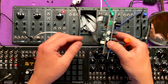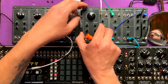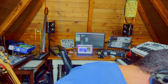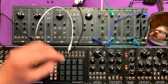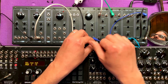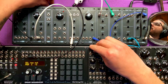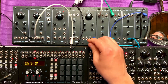So now we can put this back in the case. Let's turn off the case just so there's no shorts. Simple as that is the calibration for this module — it's really up to user taste, how distorted you want. I think this is a good position to leave it in because you still have a lot left in the resonance pot, so you can get it to be more distorted if you like.